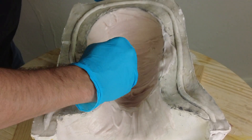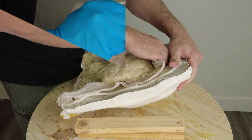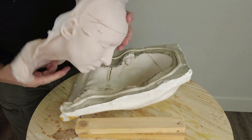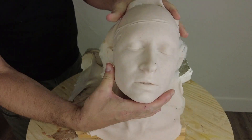When making castings, there are a lot of special effects and medical simulator applications that require silicones being thickened and brushed into a mold. There might be situations where you want a slightly runny paste for a really detailed part to make sure you get into all the crevices and surface detail, and then work up to a really thick paste that can be troweled into the mold — also useful for patching and filling air bubbles.